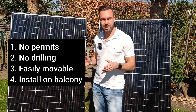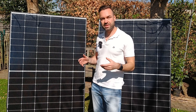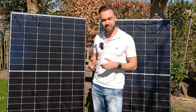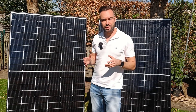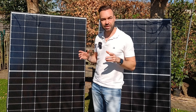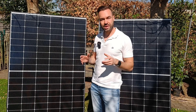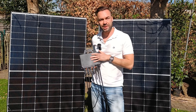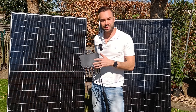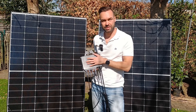You can install it on a balcony, patio, or even in a small yard. This makes it a great entry-level system if you want to save money on your power bill without going all in on rooftop solar. But if you plan on expanding to more than about four large panels, I recommend upgrading to a string inverter. Microinverters are less durable over the long term — they sit behind the panel, get hot over time, and that can reduce their lifespan.